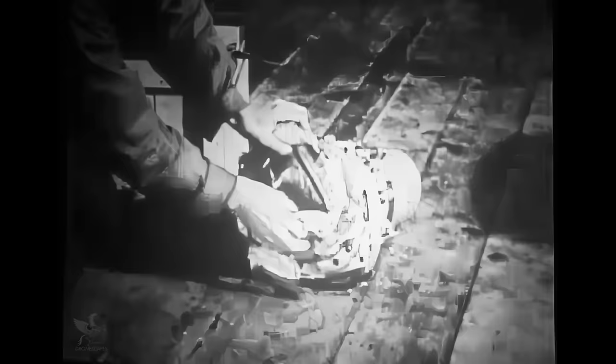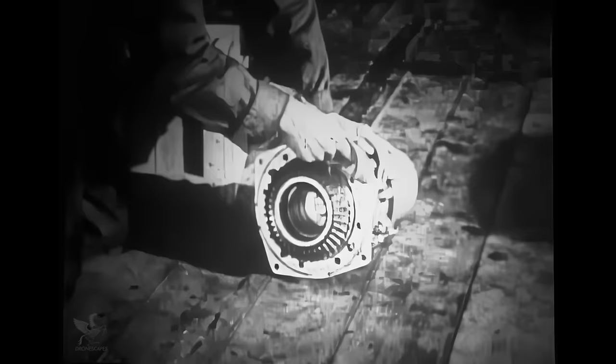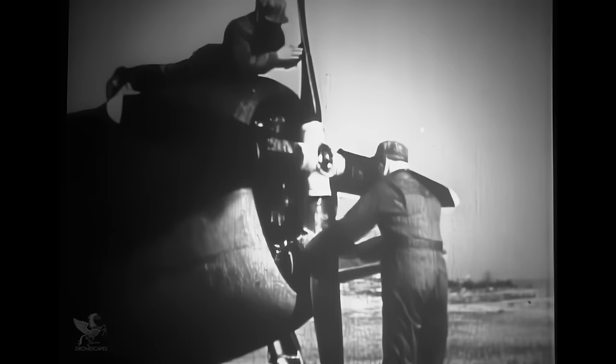The propeller hub electric contact points are cleaned and made ready to receive the power unit. The power unit itself is removed from the case and cleaned, with particular attention to cleaning around the contact points. Since the power unit is set in low pitch when packed, the blades on the propeller must be set in low pitch also.